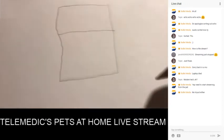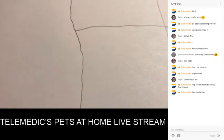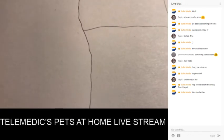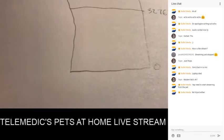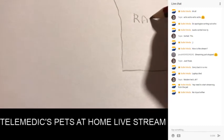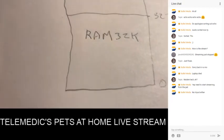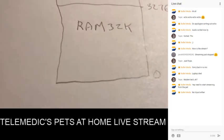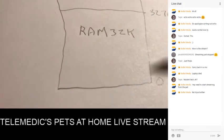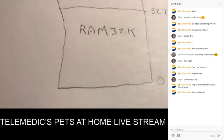So this is where I'm going to start here, which is 0. This, of course, on the top here is 32767. And that will be all RAM. 32K. So that's quite simple. As I said with that, as long as A15 is low, we will be below 32768. So that makes that quite easy to deal with decoding-wise.